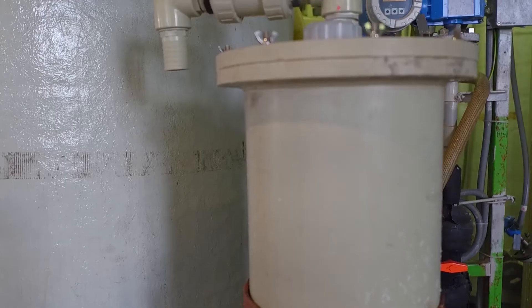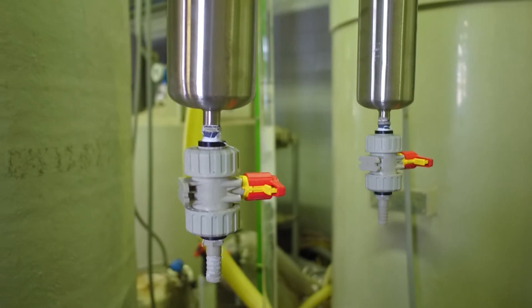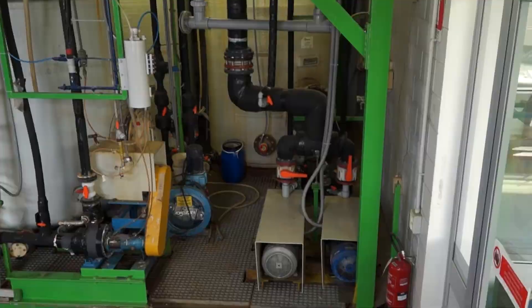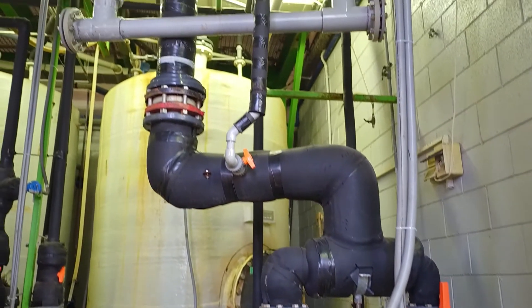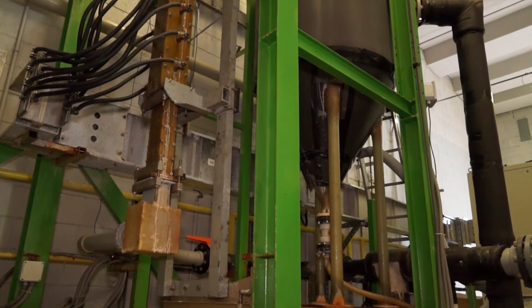In addition, a three-stage series filtration system of 100, 10 and 1 micron cartridge filters removes any fine particulate before the next stage of electrolysis. The electrolysis unit is the heart of the FAST technology. The FAST cell is a non-traditional flow cell electro-winning system with bipolar electrodes fitted closely together in a very compact unit. Clean, purified electrolyte is pumped at a very high flow rate to the cell, where a high current density is applied. Dendritic nodules grow on the cathode where the high-velocity electrolyte flow strips them and carries them out of the cell.